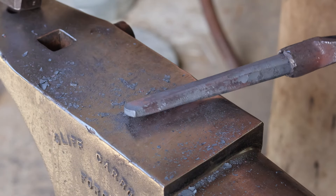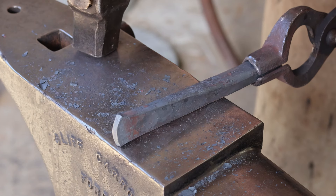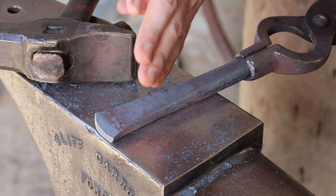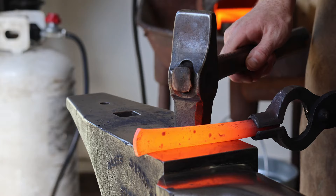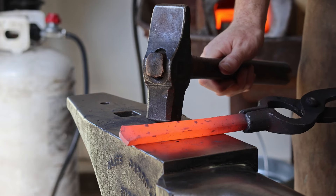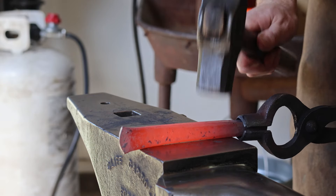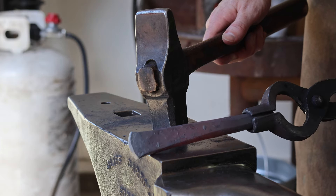The way I'm going to correct that is on the next heat — I'm going to lay this edge on the anvil, which is going to require me to lower my hand just a little bit to get that angle correct. Because if I just set this down on the anvil at normal height, most of this face would not touch the anvil face and I'd end up getting a curve, as opposed to being able to forge in those little lumps on the sides. I'm going to rest that full face on the edge and strike down in the locations where I've got a bump. You will still pick up a little bit of a curve, so to correct that you flip to the opposite side, lay two points along the anvil and hammer down in the middle until that whole surface meets the anvil face and everything lines up.